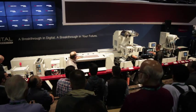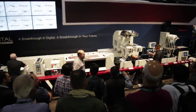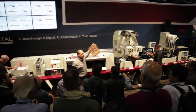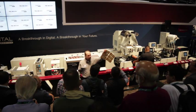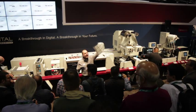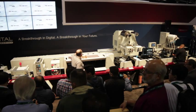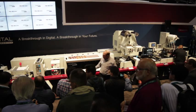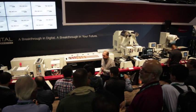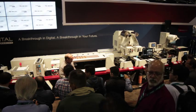We do have one more job for you. Anybody plan on having a beer later on today? Well, to get you in the mood, we're going to run this gorgeous beer label. In order to run this, we're going to do a stock change — switching over to a clear polypropylene label stock to show you the power of inline digital white in addition to digital four-color. This is a very opaque white, just like a screen unit. One thing I want to tell you: if you're just doing one digital job to the next, it's so simple — you just queue and go, queue and go. There's never any plates to change, no make-ready, no clean-up. It's really a fantastic system.